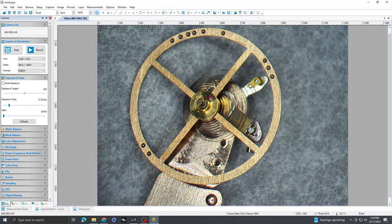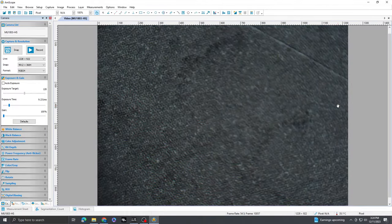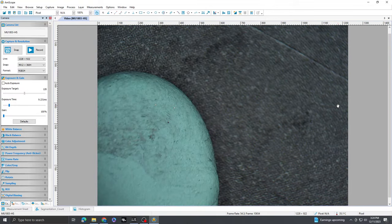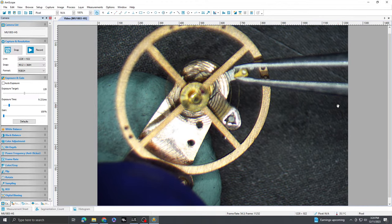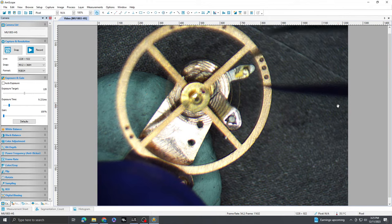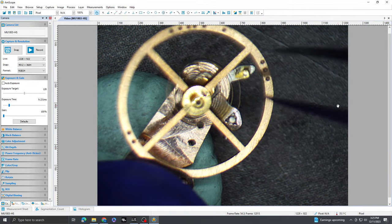So I'm gonna turn this to the left or right and release this hairspring from the regulator pins. And now what I'm going to do is this. Try to secure this right here. Okay. I'll pull it up this way. Usually there's a little tiny notch in here that you can get a screwdriver in that you can turn it left or right. There is not that. This is tight. That is really tight on there.